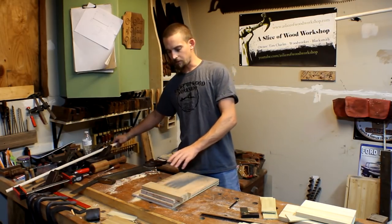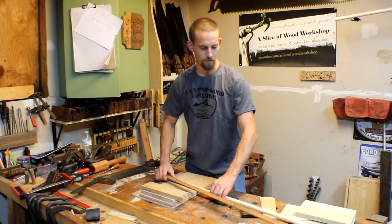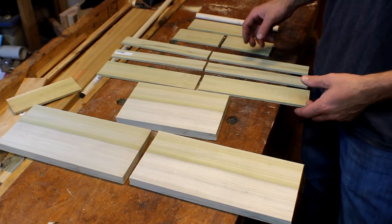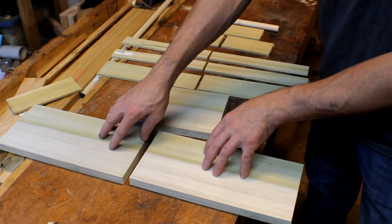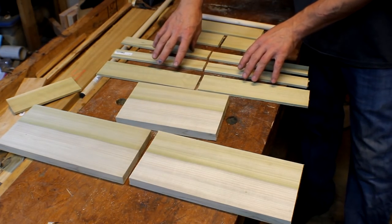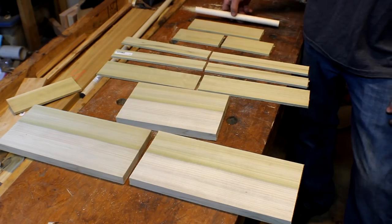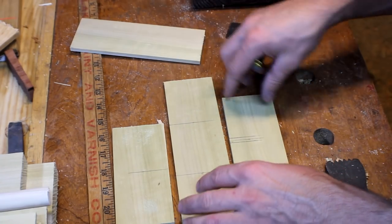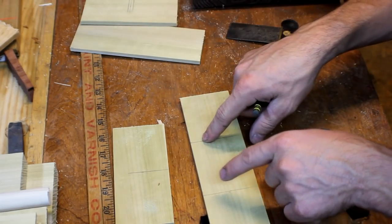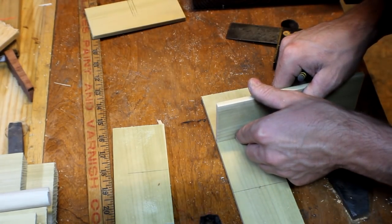Before I put away my board, I'm going to go ahead and cut the dowel, which is also going to be ten and a half inches — it's going to go right through both of the side walls. Here you can see everything is all cut out and almost ready for assembly. You have the two ends that will have the handle going through, here is the base, here are the side walls, here is the cross bracing to hold up the bottles, and here is the handle. I'm marking out for my cuts where I've got to join all these pieces together — I found the three inch and the six inch mark and I can center it up as best as possible.